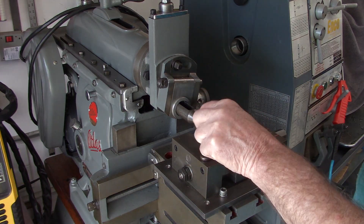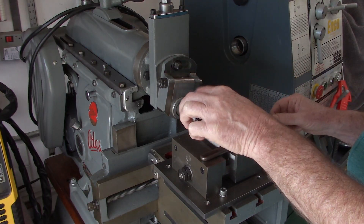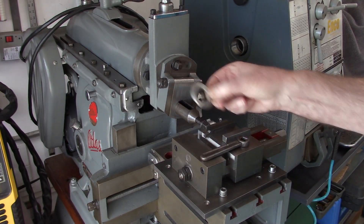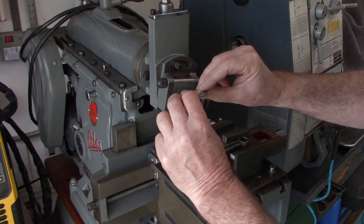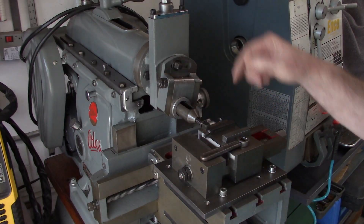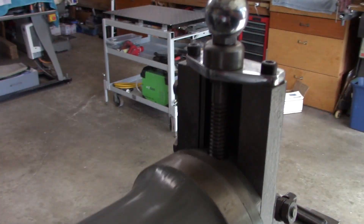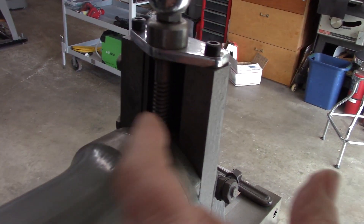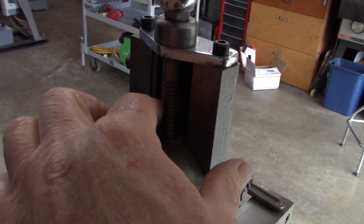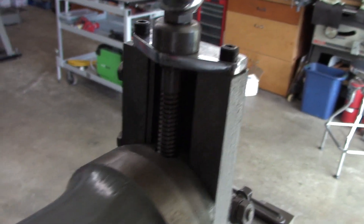So what he's missing is this screw that goes in the lantern for the tool holder, and he's missing this washer — and that's a hardened washer by the way. Let me take you around the back. He's missing the gib for this. So around the back, for the swivel downfeed, there's a gib in here — you can probably just barely see it. So he's missing that gib.